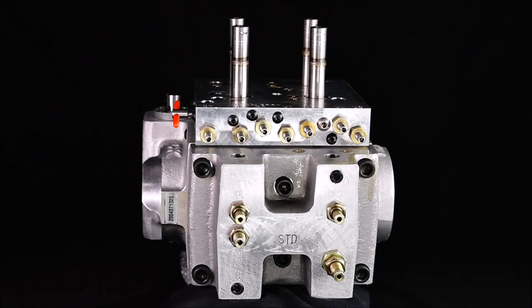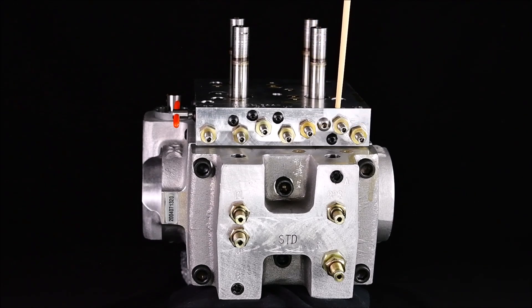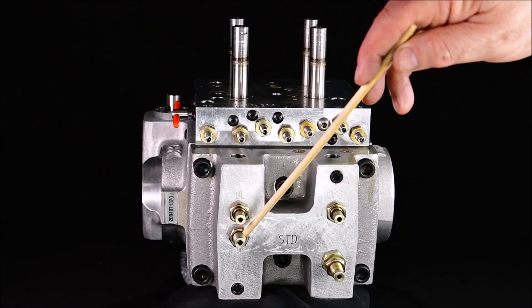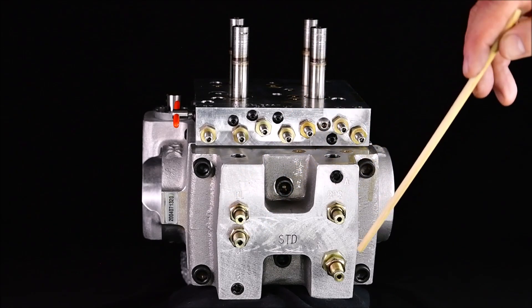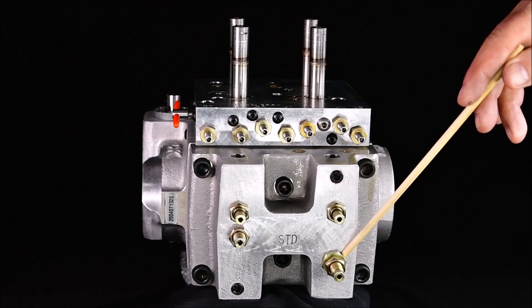Our phone number will be at the end of the video. When you get the valve out of the box, these seven adjusters will be very close. These adjusters — with the exception of the UL adjuster — all deal with timing on how quickly or slowly the valve reacts, so these should be very close. Please do not go to presets. You have your down leveling, down main, bypass, and pressure relief.